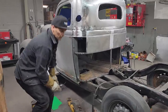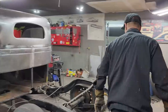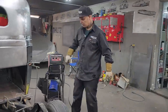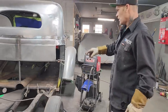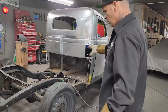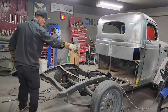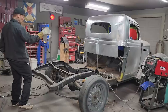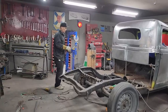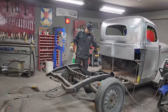All right, everybody, thanks for coming back. I appreciate it. But that's what I had to do to sort of finish the surgery of the truck. There's a bit of welding going on there to weld the floor all the way along the back, grind it off, make it look nice. I want to weld it solid all the way along there. I've got another piece of square stock that I got to make for that corner and add it onto that post. The piece that I made is not for the cab corner. It's for structural, inside structural for what's going on.